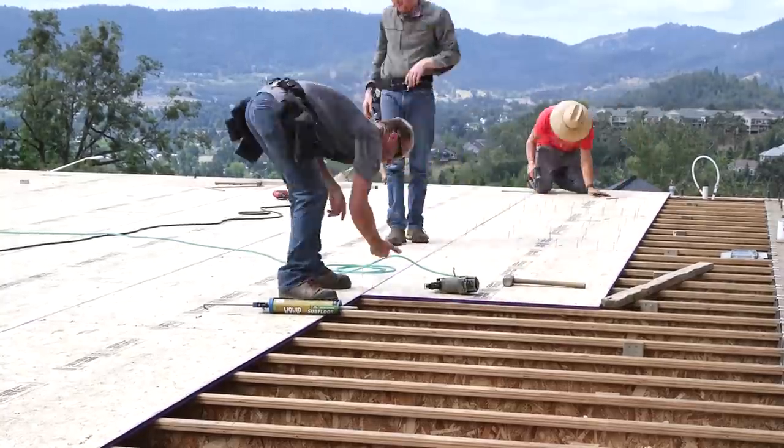These lines for fastening are huge time savers because otherwise you're making marks and trying to find the joist and you're missing and have to take your fastener out, or you're snapping across the sheet time after time after time while the glue is getting dry. So I recommend that when you pick up decking to put on your joists, you look for some and ask the lumberyard, is this going to have the centers, the nailing lines already in place? It's a time saver.